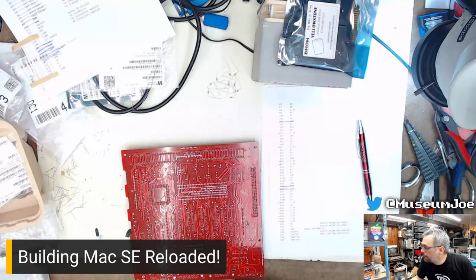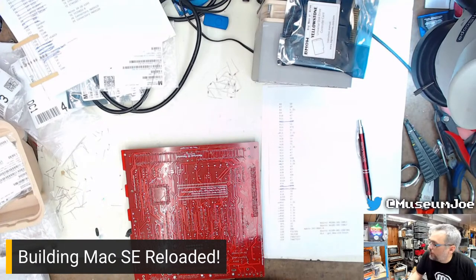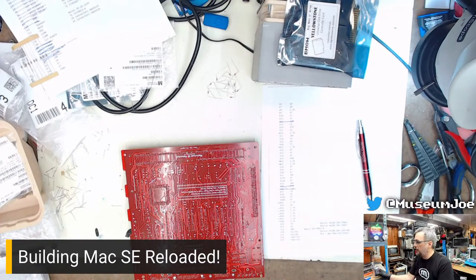Understood, Justin. Thank you. It's not working because it's mid-update. It has the new bootloader, but no blue SCSI firmware. Ah, gotcha. So you were able to do the first half, but not the second half. So in theory, you are technically able to flash the USB firmware from the ST-Link port.